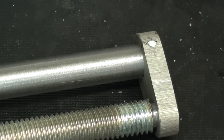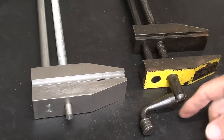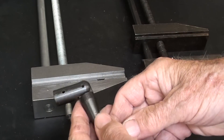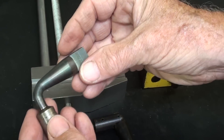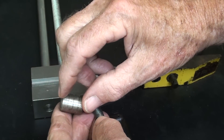I want to tackle strictly this — that's my sample that I made a few weeks ago. So I'm going to go ahead and make it up just like that, probably a little bit shorter here. It's a fairly difficult part because we've got a straight, we've got a taper, we've got it thinned out here on the milling machine — just a lot of different operations on this.